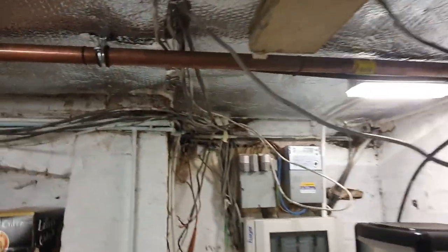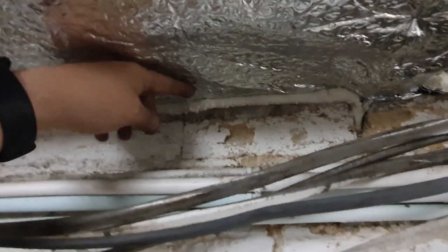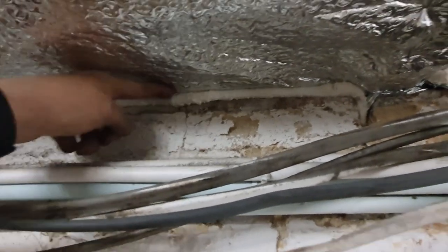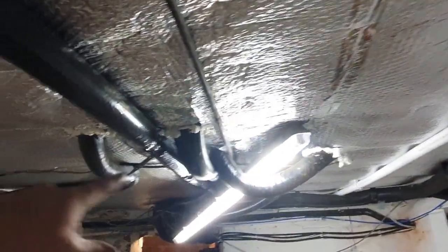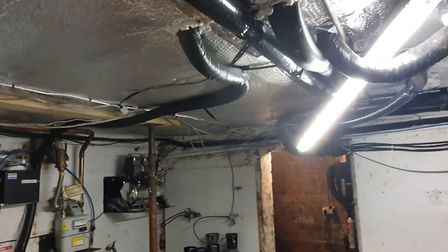It was quite difficult behind there, so I've just kind of piled it in. That'll do the job. And then over this side, it actually rests on top of the wall, and you can see it's grabbed, it's fixed the vapor barrier to the top of the wall really quite nicely. That before would have just lifted up like this. So I'm really pleased at how this has all turned out, and I found a few voids here and there where the pipework went up into the bar, so I've filled it with rock wool insulation.